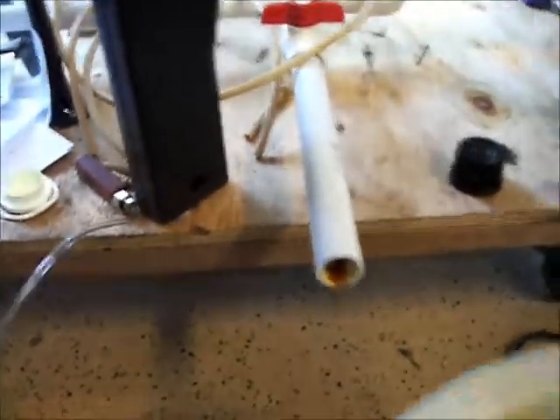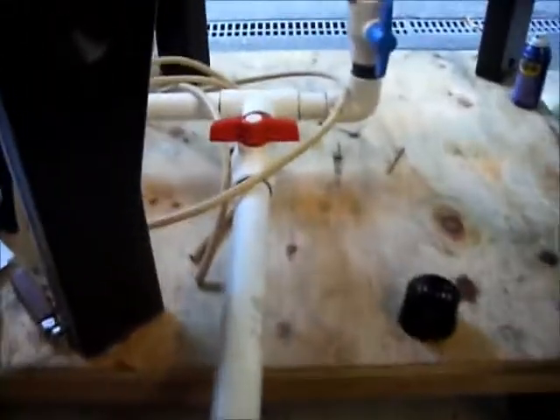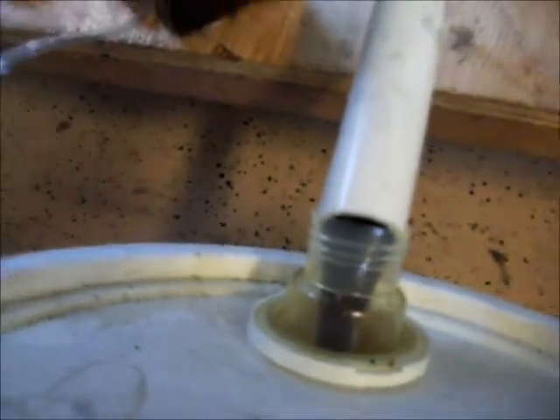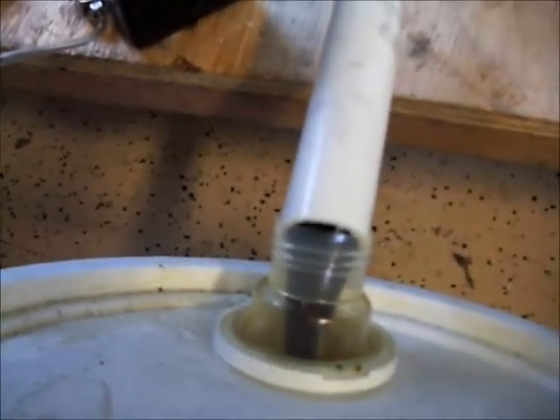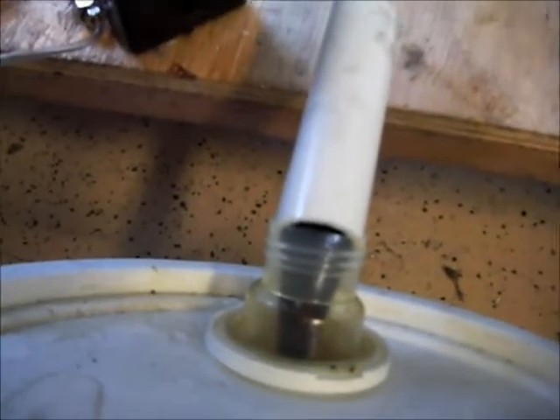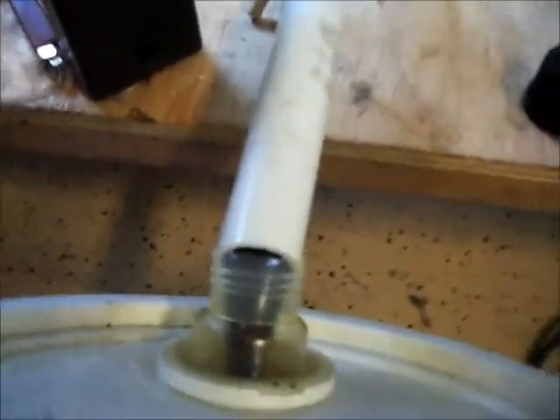This is the next morning and we've started pouring off the glycerol. It's pretty dark, fairly runny. If you use KOH it's always going to be this runny; if you use NaOH as your catalyst it won't be. The level we started at was right at the edge and it's down to there now — 13 and a half gallons of glycerol.